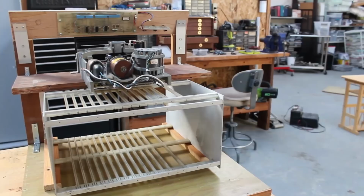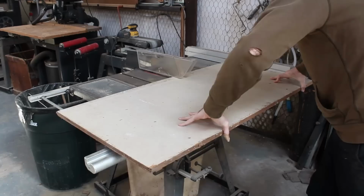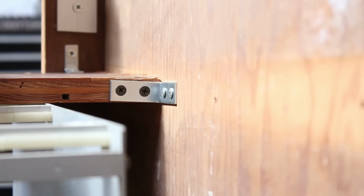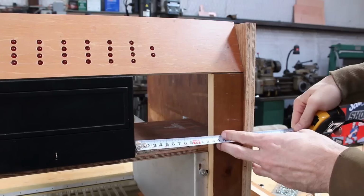All that's missing are the side panels, the filler panels, and the top panel. And so we'll start with the side panels, and I'm just going to rip these really big pieces out of more scrap plywood that we had laying around. And then those side panels will mount to the base plate on the bottom with 3 screws, and then they'll also be held onto the drive tray with an L bracket on the inside. And our little computer cube is definitely coming together, so let's make the filler panels next, which fit in right beside the drive.